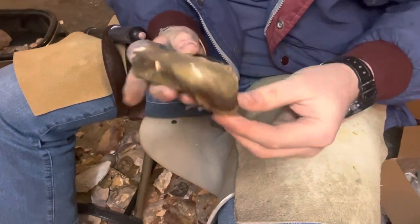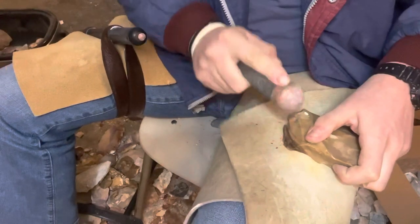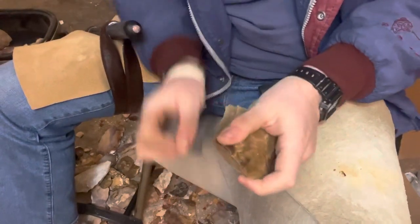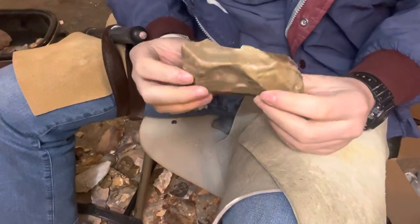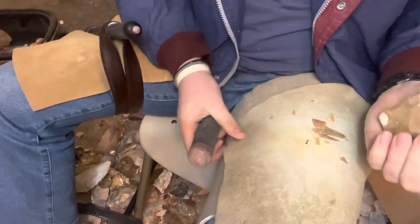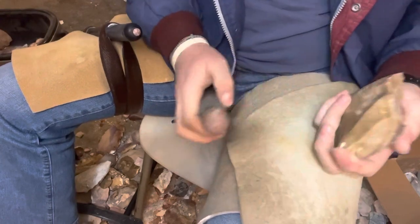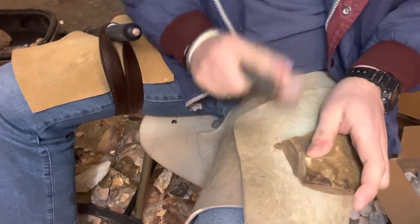This low spot contains a lot of higher quality material, while this back portion is a little bit lower quality. Keep in mind that when you're working stone, a lot of times you have to adapt. Let's say there's a nice color pattern you really want to keep — you kind of have to work around the stone, work with what it gives you, and try to make something out of it. You can go for something normal, but if there's a little pretty portion you want to keep, sometimes you have to take some liberties, hit a little bit higher and clean that whole face off. Bevel this edge — now I've got a nice platform there.